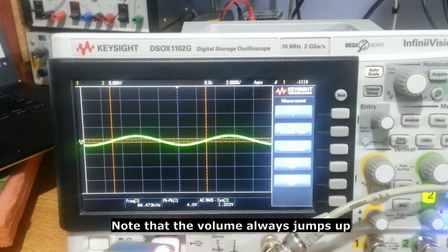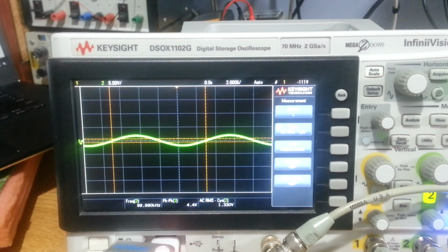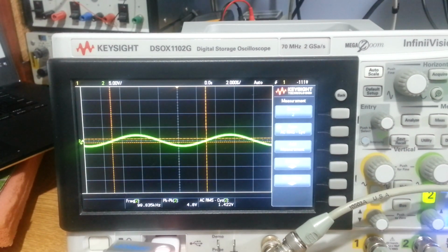It's terrible. But obviously the Class A has got a reputation, comes with a particular sound that is actually very pleasant. So anyway, that's our volume control problems. And we'll make a bandwidth measurement on this before we start to do some particular measurements on distortion and things like that. In actual fact, on these modern scopes, we can do a frequency response plot quite readily. So I'm just going to set that up now, and we'll run that measurement.